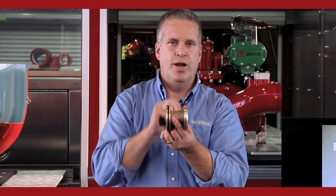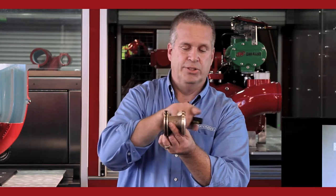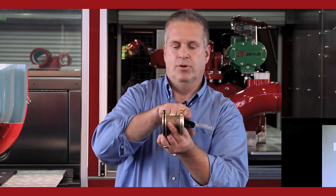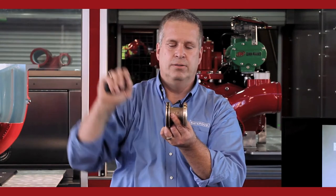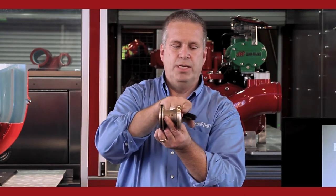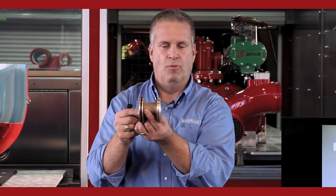Right. You shut down another hand line. Okay. Pressure is going to rise more from that hand line being shut down on this side. So that extra pressure goes up to the pilot valve, dumps back to the intake. So that results in the pressure being even higher than the pressure in the back cavity because it's still 150 back here. Valve opens up a little more.